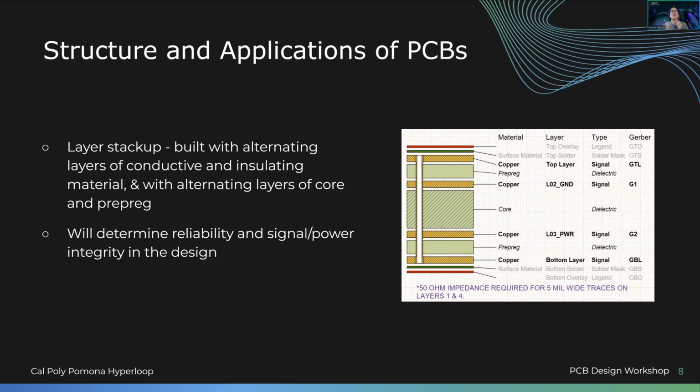we can definitely dive into this, but I won't dive into it. Okay, so a core is basically a dielectric. It's a piece of insulating material that is wrapped around copper on top and bottom. It's basically laminated together. So for example, the copper that we see right here, where there's a core and there's a copper, those are two coppers already sandwiched together. They'll sandwich this prepreg on the top and bottom, which you can see as glue in the simplest form and simplest communication. It's like glue, but it's an insulator as well.